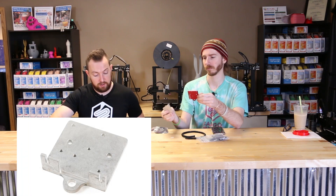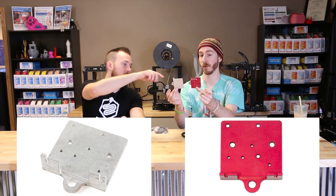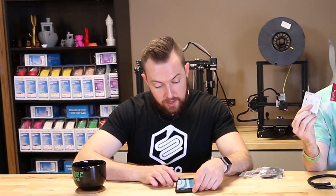The carriage has also changed a little bit, at least on the Ender 3 kit. Before it was unanodized aluminum; it's now anodized red aluminum. They've also added a new hole for a stepper motor which allows a BMG extruder from Bondtech to be mounted when paired with an E3D hot end. There's also an adapter that would work with something like the Mosquito hot end, which a lot of people want because it's lightweight. These two screw holes are where the BMG sits. The hole isn't threaded, so you can tap whatever thread you need. And we've got some laser marking on here, which is just for aesthetics — it looks cool.